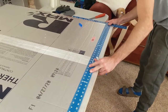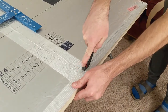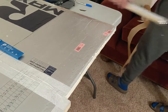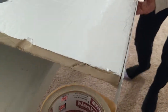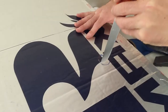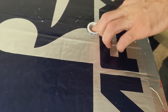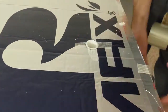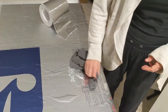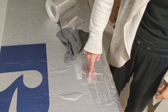The final panel that we didn't seal will be the door. Measure and cut one inch off the bottom to prevent the door from dragging on the ground when opening. Score it with the box cutter and then use the long blade to finish the cut. Seal all three edges of the door with aluminium tape — you don't need bifilament as the chances of these edges scraping on something are low. This door uses a simple design with a hole on the door and opposite panel that can be tied or locked with chain or rope. Mark and cut out the hole a bit higher than halfway down the panel. Fit a piece of one inch PVC pipe snugly into the hole. Take strips of bifilament tape and loop it halfway through the PVC, attaching it to the panel from the inside and outside — four pieces should be plenty. Cover the exposed tape with aluminium on the outside. When done, just poke your finger through the hole and smooth it out. Now repeat the process on the other side of the 12 foot rectangle.